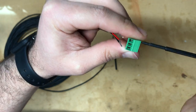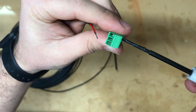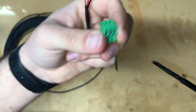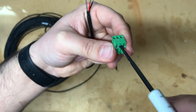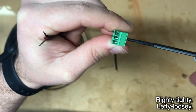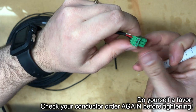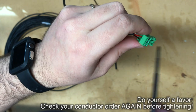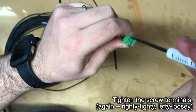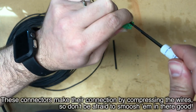Some connectors, when they're closed, can be hard to distinguish from open ones with a quick look, especially in poor lighting. It doesn't hurt to stick your tweaker in there and open the screws. These captive screw connectors work by putting a tweaker into a screw and turning it — tighten to close, loosen to open. It's basically just a little grabber for the wires. Once your conductors are in, each in their own slot, with no stray strands touching each other and nothing shorting out behind, tighten the screws down until they're nice and snug, then give them a little extra tightening after that.